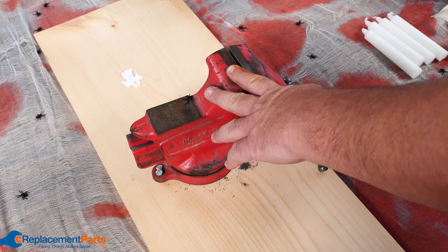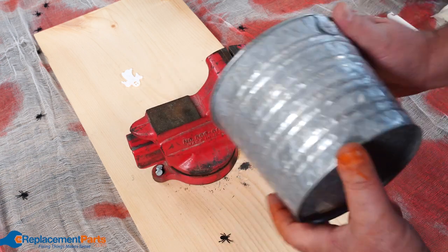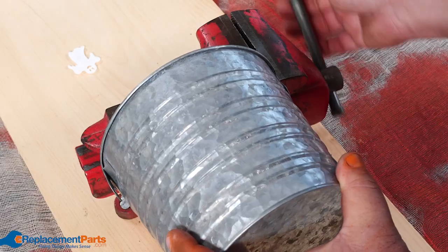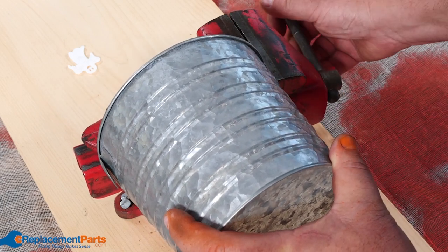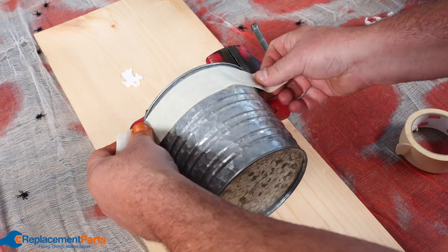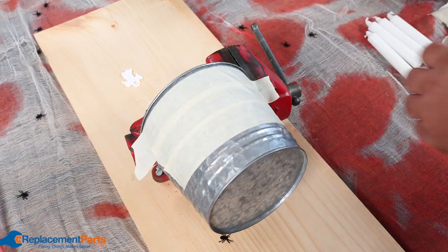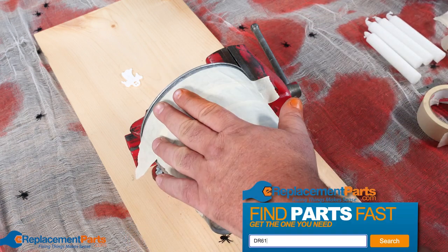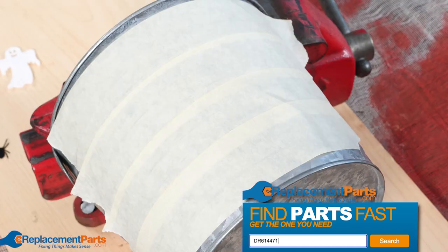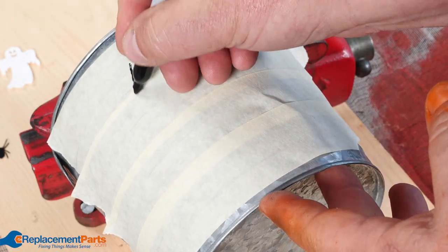When we get ready to do our actual work, we just have this vise that's actually mounted to a piece of wood to keep it nice and solid. We'll just put our bucket in here and lock it in place so it's not going to move while we're doing our cutting. So instead of trying to find special pens that write on steel, what we can do is just put masking tape directly onto the bucket, and that provides a nice surface that any kind of pen or marker will draw onto.